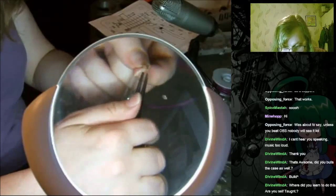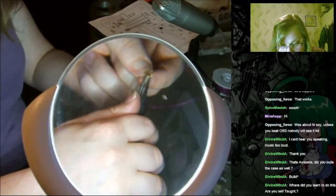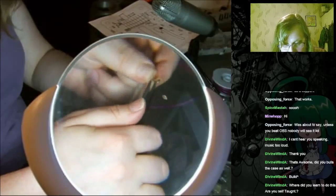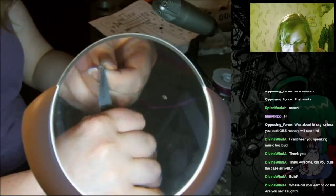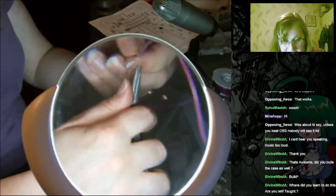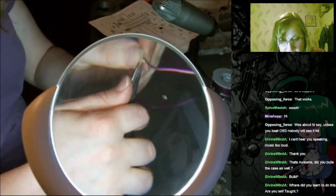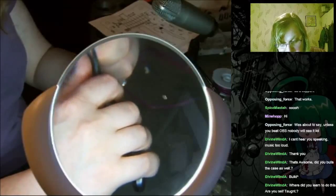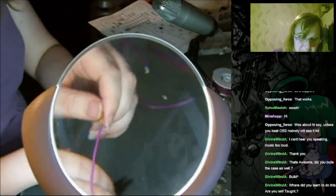As I said, I've got lots of spare crimps because they don't always work. Let's just get that lined in there and pushed in. Let's squish that in place and crunch it, and do the same for the other bit. That's sounding a bit more positive. And I'm just going to make sure I do the same for the sheathing as well. So we're just going to loosely put it there and just curl it around the wire. And the same for the other side, give it a good squeeze. Right, that's much more solid.